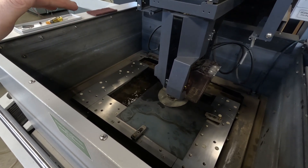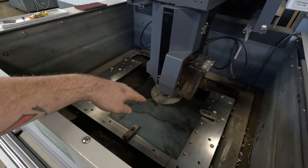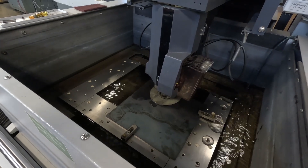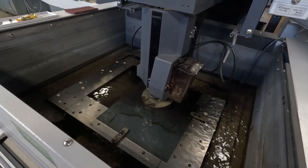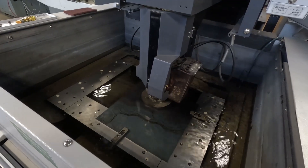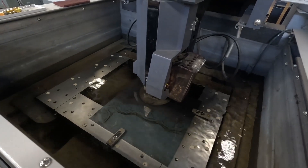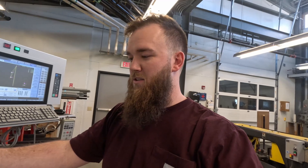The whole trough area is filling up with water. This water is filtered so that it provides an electrical barrier between the plate and the wire. Pure water does not carry electricity — water full of minerals and chemicals does. I could actually stick my hand in this while it's running and not shock myself, but I won't. While this is cutting I'm going to go over to the lathe and prep some of the table legs.